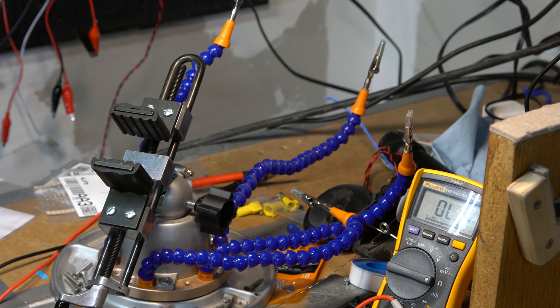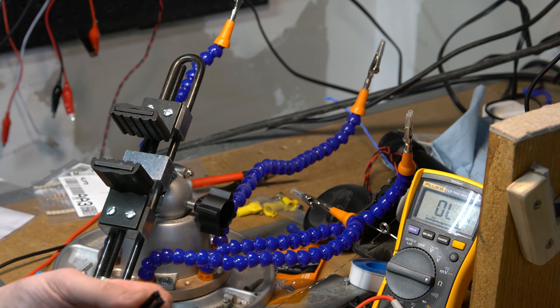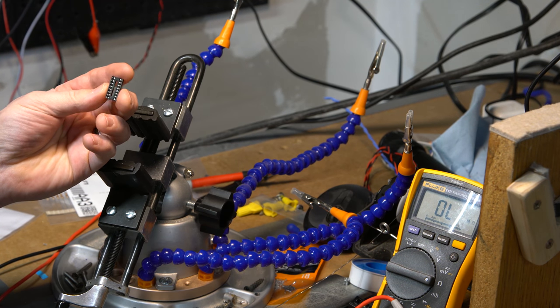because the relay itself, as it opens and closes, can create a flyback voltage that can be fairly high and damaging to a lot of stuff. So you put the diode in to protect it from going the wrong way, so it'll end up having the inability to toast things effectively. So the way this is supposed to work now, and I've not done it before, this is the type that's for the relay socket, but you don't need all these pins.